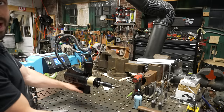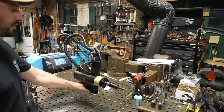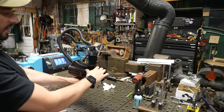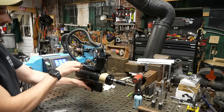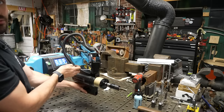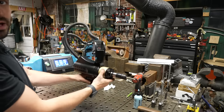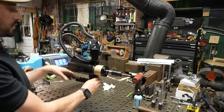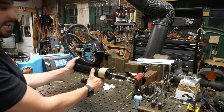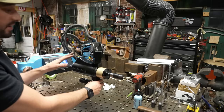Now this will remain parallel with the work table and you could tap the end of a piece of tube or rod. The thing can float so as you're going, it's moving straight and staying co-planar. There are two little grub screws that can adjust the amount of resistance, so you could tighten those up to make it more rigid. But the tap is honestly going to pull itself because it's cutting threads. You can tap horizontally like this because without a lathe, this would be a really difficult operation to do.